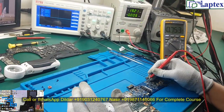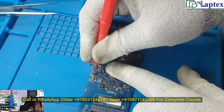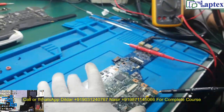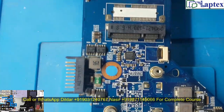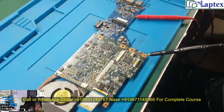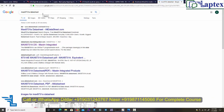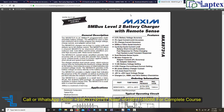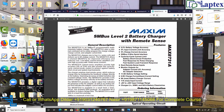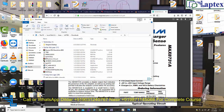Ultimately, on this sensing resistor we need to get the 19V DC input voltage, but we are not getting it on this point. For reference, on the daughter board I can see the MAX 8731A IC. Let me find out the datasheet on Google and download it.